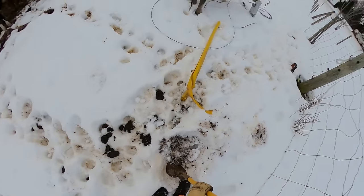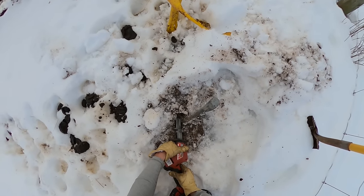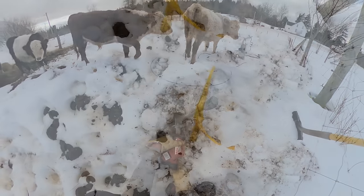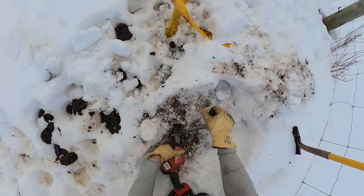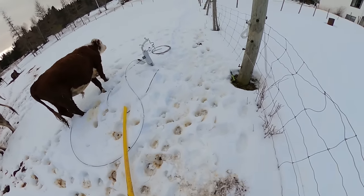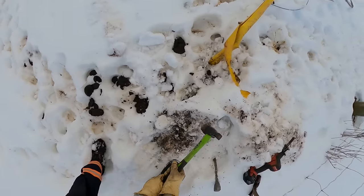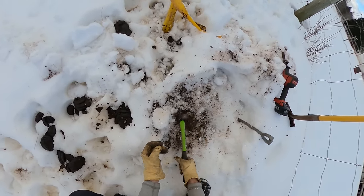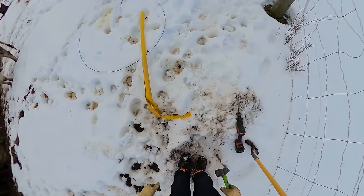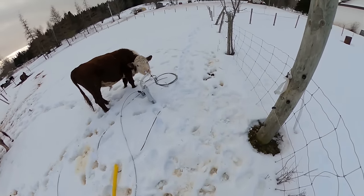There's quite a bit of frost in the ground - I only got down maybe three or four inches around the anchor rod, but it was enough that I was able to cut it off at ground level. I'm going to spare you the x-rated stuff that happened there and just fast-forward. I'm able to take the hammer and drive that anchor rod into the ground another couple of inches. I advised the customer afterwards that the anchor rod was cut off and is currently about four inches below soil, but to keep an eye on it in case when the frost comes out of the ground it comes up at all.